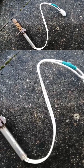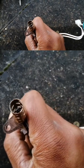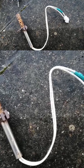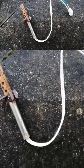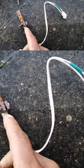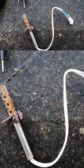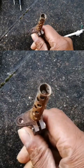Welcome to the commercial gas engineer channel. This is a hot surface igniter — it's most commonly used for electric ignition. It works like a light bulb filament, heating up when electricity passes through, and when the gas valve opens it ignites the gas. It's mostly made from silicon nitride or silicon carbide.